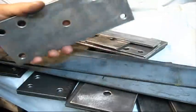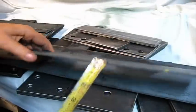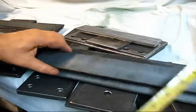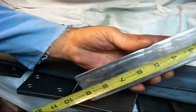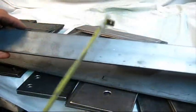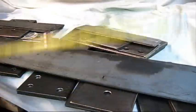We build engine carts today. The cross piece steel that I use under the engine bolts is 1/4 inch thick, 2 inches wide, and then however long you want the cart to be. Like so, that would be a 9 inch wide cart. It's just regular hot roll steel. If you're going to build a cart, you might as well get about 20 foot of it and start sawing.